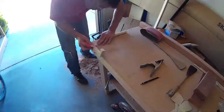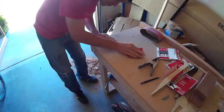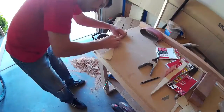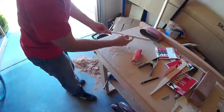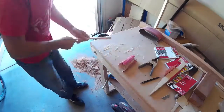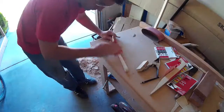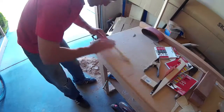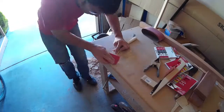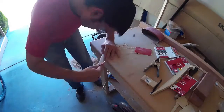Then I go back with 100 grit by hand just to finish sanding off some things. I squared off the end, then started sanding with 150, and then up to 220, trying to get it as smooth as possible. I like to go back and reshape and re-sand, going between grits because I find it's needed sometimes. Here I'm actually using a razor blade to scrape it — it cuts all the little fuzzy hairs off. You can also spray water on it and then sand with 220, which helps you see where the deeper sand marks are.